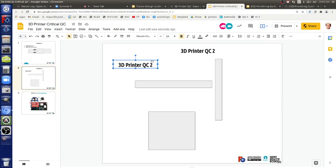I think it'll probably still work with 4 or 5, because we said we've got 18 pounds of available force. But what that does mean is the torque curve of a motor is like this. It's not the same torque at all speeds. When you're very slow, you're near full torque. But if you try to go really fast, you have only half the strength of your motor, down to like 30% at very fast speeds. So the more friction you have, you won't be able to achieve the highest speeds. That's the limit. So you can print slowly. If you're only doing 25 or 50 millimeters per second, perfectly fine. If you want to push it to things you could print with, like say 200 millimeters per second, 4x the speed, you're going to see layer shifts, which means you're printing and then you jump steps and the layers shift, and all that.